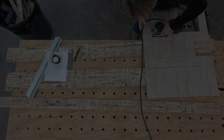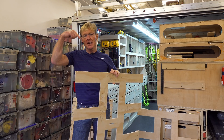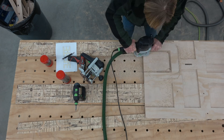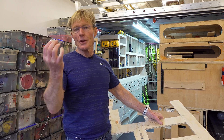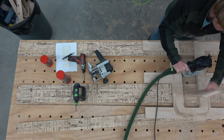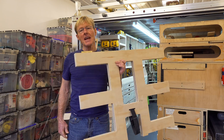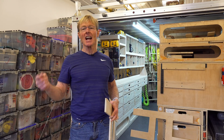So instead of making each one individually, I'll take my time and with traditional woodworking tools — drill holes, cut straight lines, do a little bit of sanding to clean it up — and then I have my pattern. This is my tangible pattern that the CNC machine has in its memory and follows with its router. I attach my template to the material I want to cut using a few screws or double-stick tape so it won't move, put this bushing on my router with the appropriate cutter, and the bushing follows my pattern. Once the template is made, I can cut out these sawhorses faster than any CNC machine I've ever worked with.